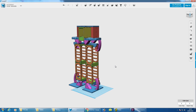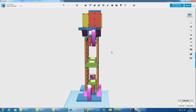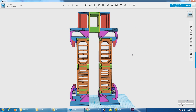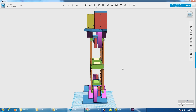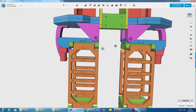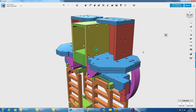Here's the CAD version of the robot. Very approximately, the tops and bottoms of the legs are parallelograms, which always keep the body bolt upright front to back. Side to side, the ankles and hips are independent with pivot points and the gear tracks I put in last time. This means it can compensate by throwing its weight side to side with the hip and ankle joints, but front to back it always stays upright. So I've put an additional hinge in around the waist, which is going to be dynamically driven by the inertial measurement unit to compensate front to back.